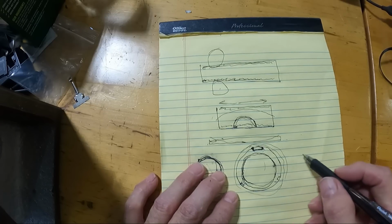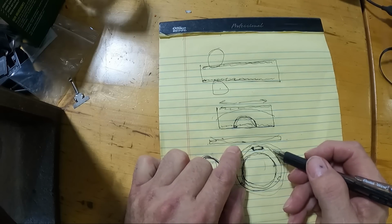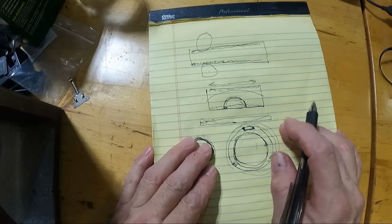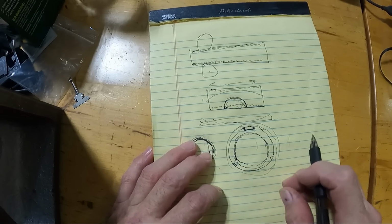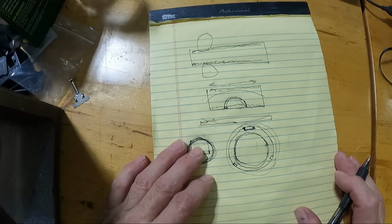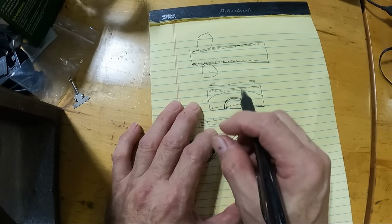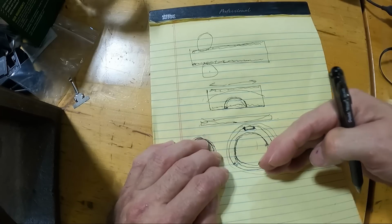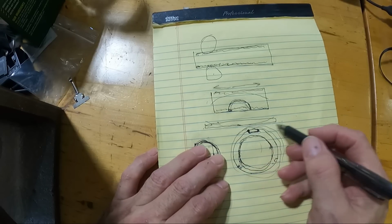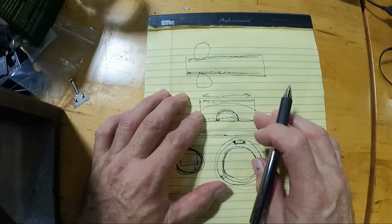In many YouTube videos, I've seen people weld on things. Welding is another way to throw things out of tolerance, or you can even straighten things with welding if you do it correctly, or with heat, like Keith did on Turn Right Machine. He straightens shafts with the torch, throwing water to cool the spot heats, and you can straighten a huge shaft that way. There's a lot of force involved with just a little heating, a spot maybe a half inch in diameter, almost red hot, and then you throw water on it and quench it, and it'll bend a big huge shaft. There's that much force involved. So anyway, these are the ways that things cause distortion in metal parts.